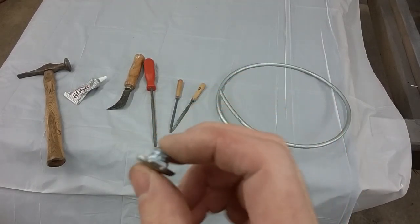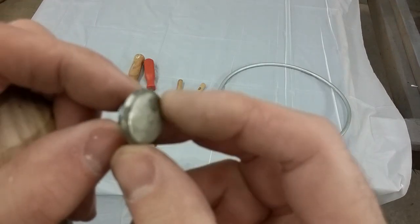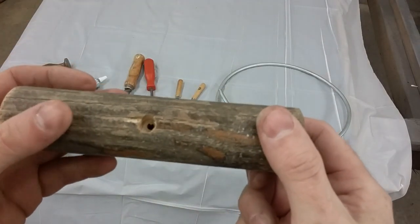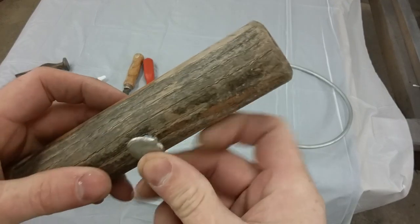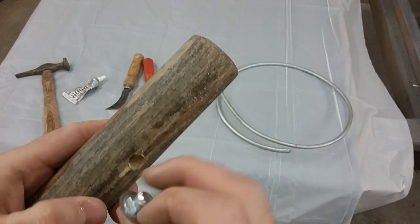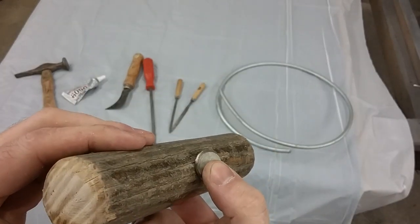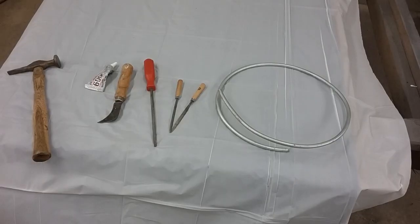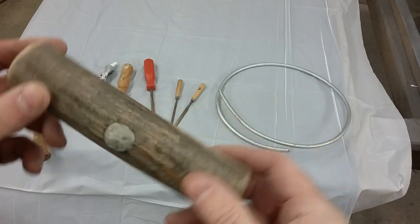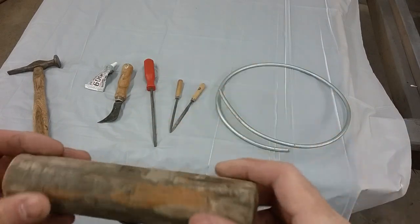I took the carriage bolt and cut it down with the hacksaw — it's really short now. I got the little square edge right there. I ground the stainless steel cap off and put a little edge on it. My plan is to go ahead and press this into the bottom of the handle. I'll put this on a bench vise and smash it in — you can also beat it in with a hammer. I'm gonna put some E6000 glue in there and it looks like our meat hook actual metal part will be all the way through. We still got our little pilot hole all the way through.